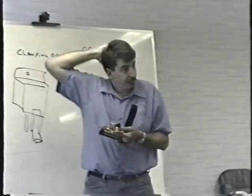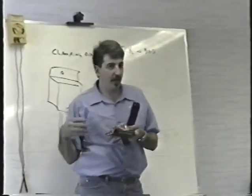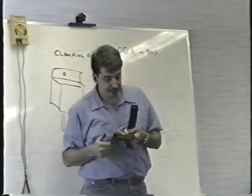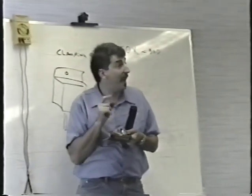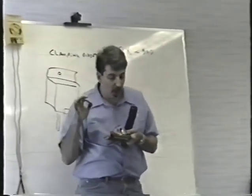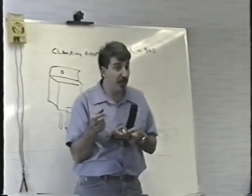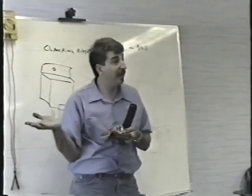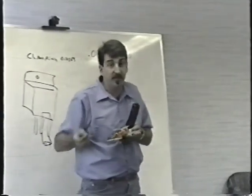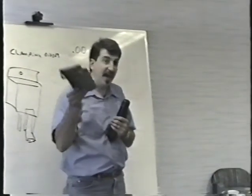How'd you see it go across the short with the diode setting? Well, the diode setting and the low ohm setting are basically the same. It just interprets the display a little differently. Actually, I shouldn't say that, because the difference is that in the diode setting, it puts out about 2.5 volts. In the ohm setting, it only puts out 0.4 volts. It does that intentionally so that when you're measuring resistance with your meter, it ignores semiconductors. It's putting out less than 0.7, so it completely ignores the semiconductors. It's like they're invisible to the meter, which is a really nice thing, really. So, hey, that's good. I feel better now.